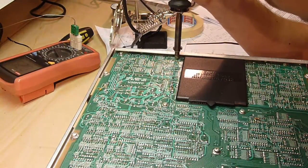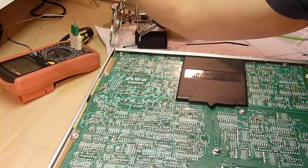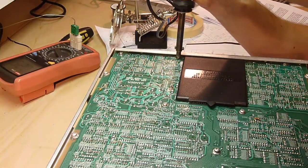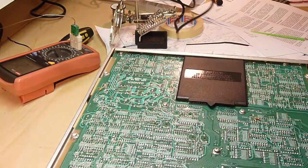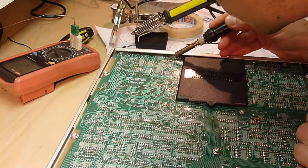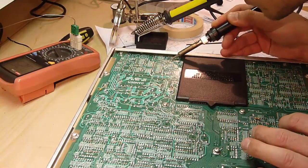I applied a little bit more fresh solder on every joint before I started doing this. Just to get rid of some solder from the inside, just to make sure that it melts quicker. Okay. That seems to have worked pretty well. Just get my iron and just touch the ones that are all bent, so I'm just going to straighten them all up with my iron.